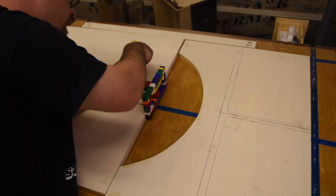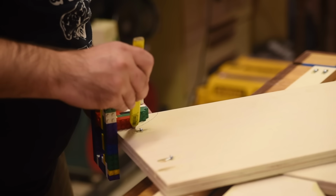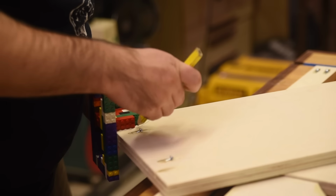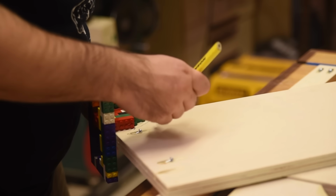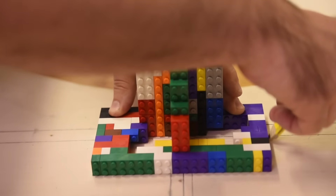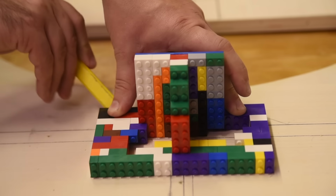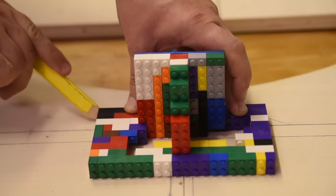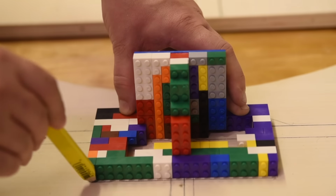Either out of penance or artistry, or maybe that's a false dichotomy, some of these inlays are set into joints where 3 pieces of wood meet. And believe it or not, those inlays aren't any more difficult to cut than the simple ones. I just spent a lot more time finessing them into position before marking. But if patience isn't your thing, then make up for it with wood putty, or skip this altogether and probably have a stronger table.